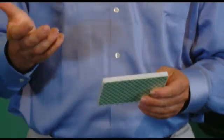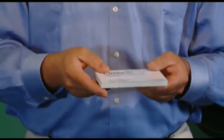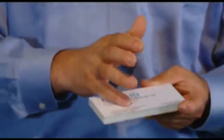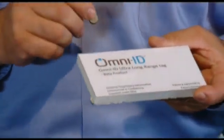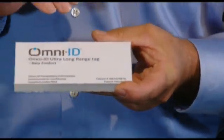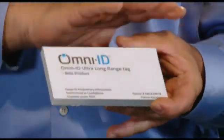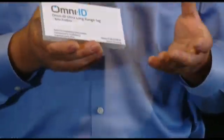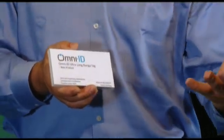You don't use a traditional antenna in here? We have our own design loop antenna and our product is patented. We use a theory of plasmonics, and what we do is we harvest the energy more efficiently than a standard dipole. We put a loop antenna in the appropriate location on our product — we have about three or four design loops now. Along with the structure, this plasmonic device, is what helps harness the energy coming into the tag and then sending it back out more efficiently.